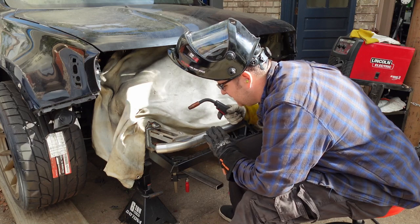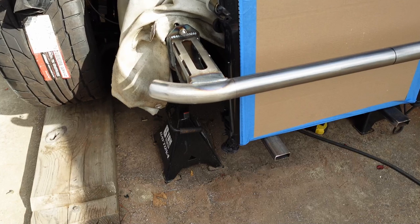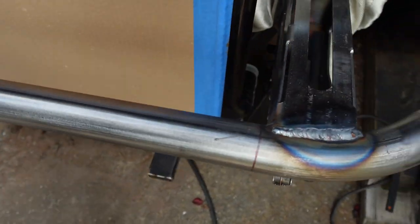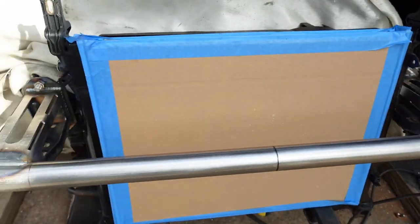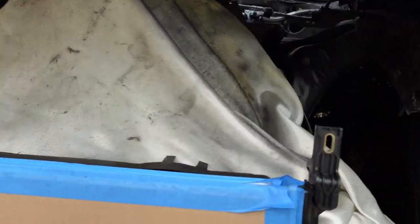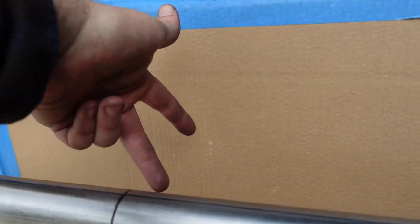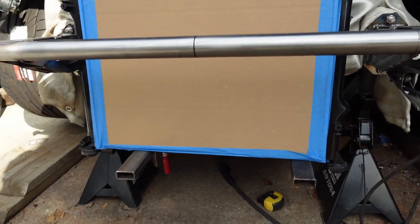It's not half bad. All right, yeah, actually turned out pretty good. So got the front bar solid welded on, still gonna be cooling off for a while, but when I threw the radiator in there, I figure lower support, upper support, gonna have to tie in those factory style mounting tabs. Gotta leave a couple inches of clearance for the AC condenser. Guess I'll go ahead and start whipping up a lower support and get that thing going.